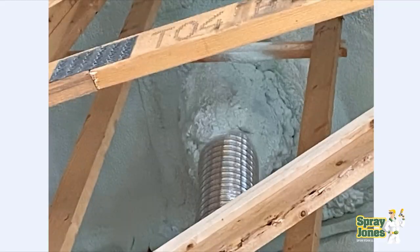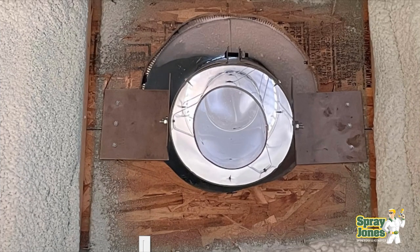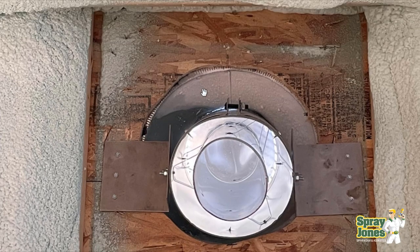I want to show you a picture of the roof penetration — the thimble. I'll zoom into it. This is what's going on outside of the roof deck: a sloped flange, or thimble. The vent pipe goes through the middle; it's going to be flashed, caulked, and sealed on the outside. So here's your hot flue gas going up the middle and your cold combustion air coming down the outer jacket.